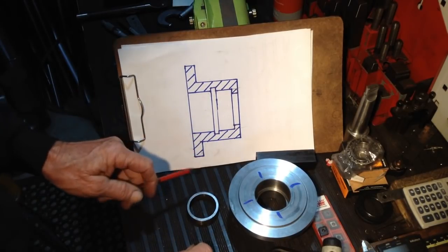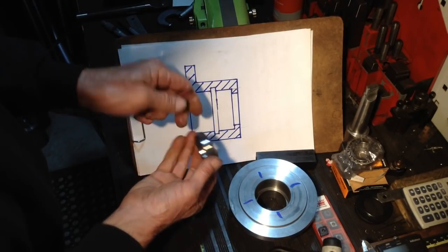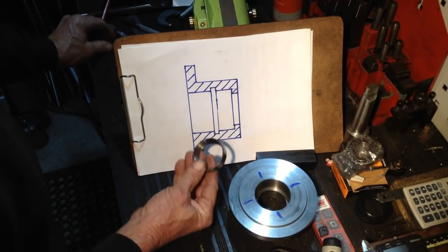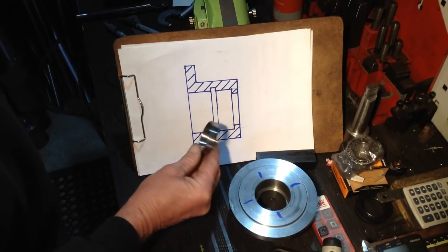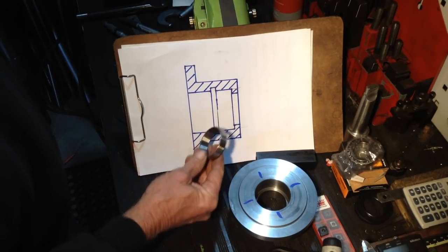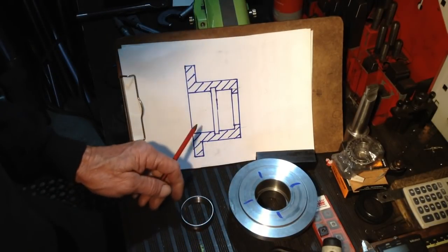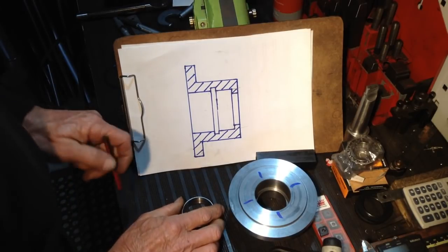There is another way that was mentioned, which is a car wheel bearing assembly, which is like a double cup, and then your cones sit in from either end. The problem with that method is, unless you're familiar with car wheel bearing sizes, as far as I know, they're sold by model of a car and part number, so you don't really know what size bearing you're going to get until you open the box up. So that was never going to happen with this one. For me, it's easy to just go down the bearing store, $47, I've got two cups, two cones, two oil seals.